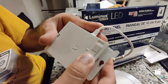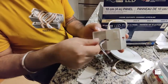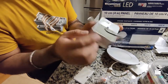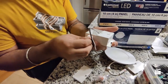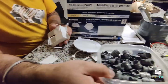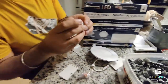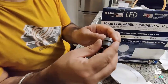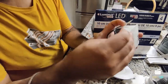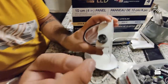The temperature range goes from 2700 to 5000K — we'll set it to 3000K. Inside the box there is a live and a neutral wire, and these are the two connectors. On both sides there is a knockout, so we've decided to open this side — just twist it and throw away the plastic. These are the cable connectors from Home Depot: very easy to install, just push the slider and the small part goes inside. These are half-inch ones — it will hold the wires so the connection is always secure.